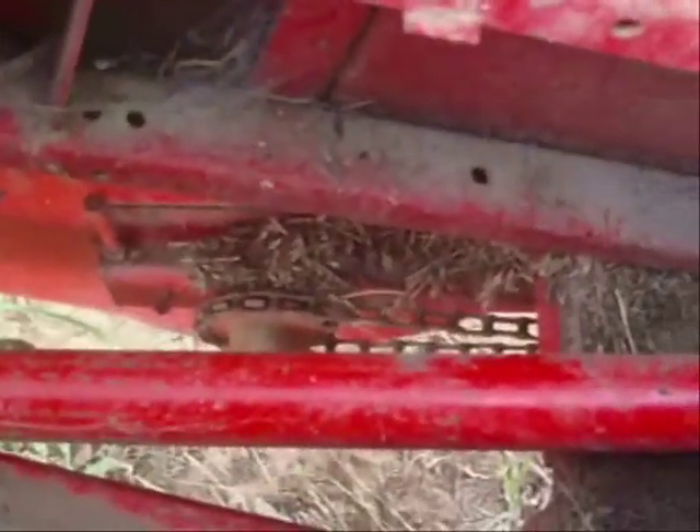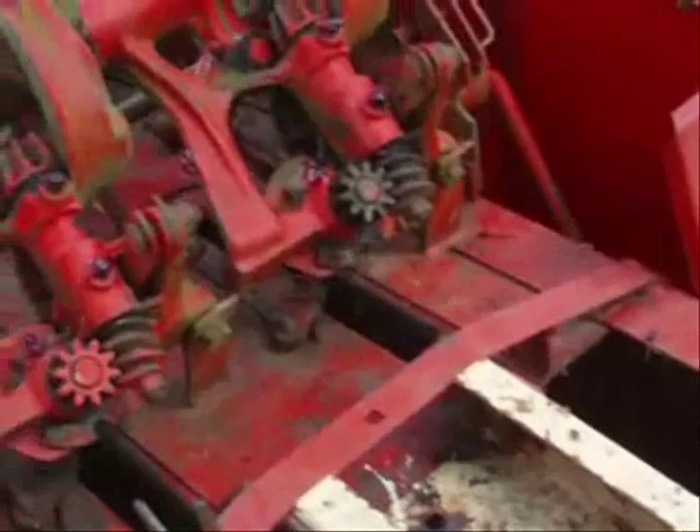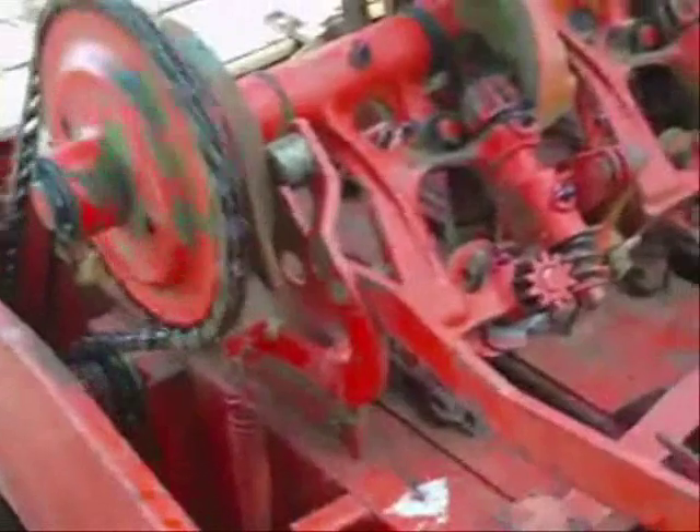Be careful — there's one chain down here that's going to be hard to get to; it's the sweep chain. I'm hoping I can get to it from the bottom. It's the moment of truth — I've got all the chains greased up, so this is going to tie. That knot hung up on that bill hook right there — that didn't come clean. Looks like it's not quite getting into the knots on this one, but it's pretty good on that one. The only thing I know to do is take it to the field and try it out.